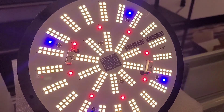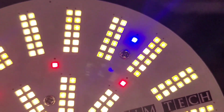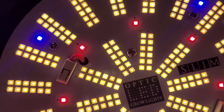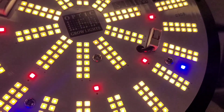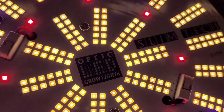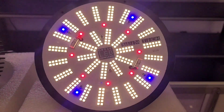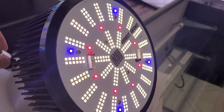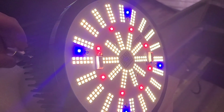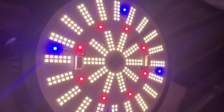Switching over to the Fatslim 1XL Gen 7, this powerhouse of a unit features 372 total LEDs. 8 of them are the LH351HV2 Deep Reds and 4 are the Samsung LH351H Royal Blue diodes. The Fatslim 1XL Gen 7 also features a dimmer to allow you to dim it from 0% to 100%, backed by that same pin-fin designed heatsink to keep that heat down.